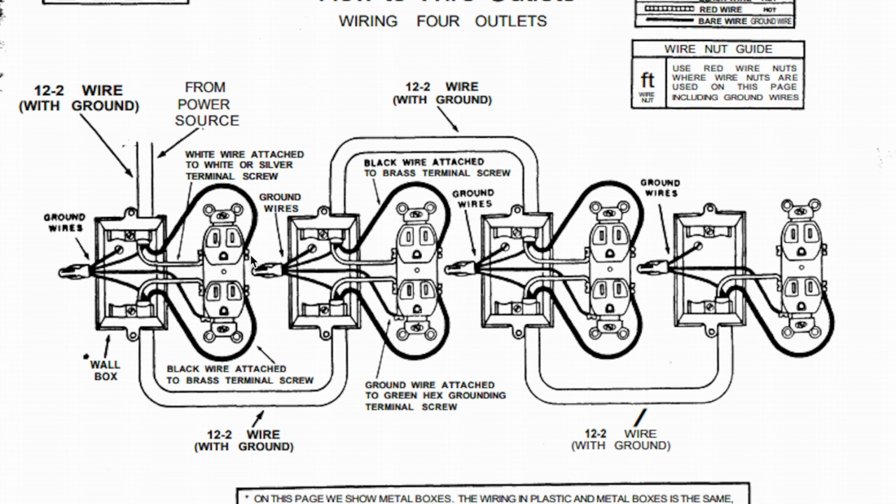I also want you to notice that this black wire comes into this outlet and then it goes out right here. Now, again, in a second, I'm going to show you this outlet, and these 2 terminals are actually connected by the back plate. So this is actually connected from here over to here, and we'll talk about that again in a second. Also, we will not be able to mount our ground into the box because we are using plastic boxes. So just be aware of that. And then again, we are going to always mount our ground into our circuit right here.